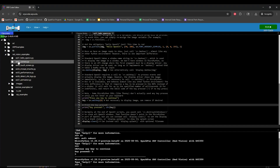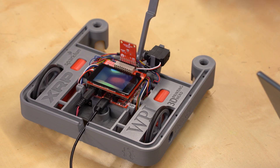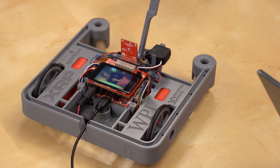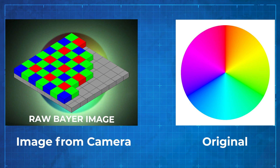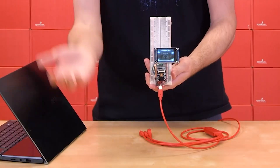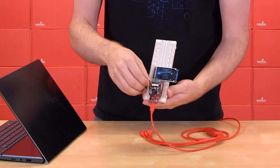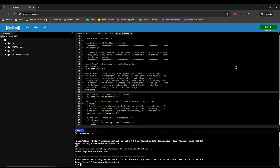Example 2 can be used to verify that the camera is working. Double-click to open, then click the Run button in the top corner. After a moment, you should see the live camera view on the display, which means your camera is working as well. With this camera and display, you'll only get around 5 or 6 frames per second because there's some color space conversions happening behind the scenes. You may also notice that the image has a green hue to it, which is because this camera module outputs a raw Bayer image. The driver does de-Bayer or de-mosaic the image, but no color grading is done like webcams, so it results in a somewhat green image. There's also a fairly strong vignette effect from the lens, making the image darker at the edges. The image quality is admittedly not the best, but the trade-off is that this camera requires dramatically fewer GPIO pins than other cameras. To finish, click the stop button or press any key in the REPL at the bottom.